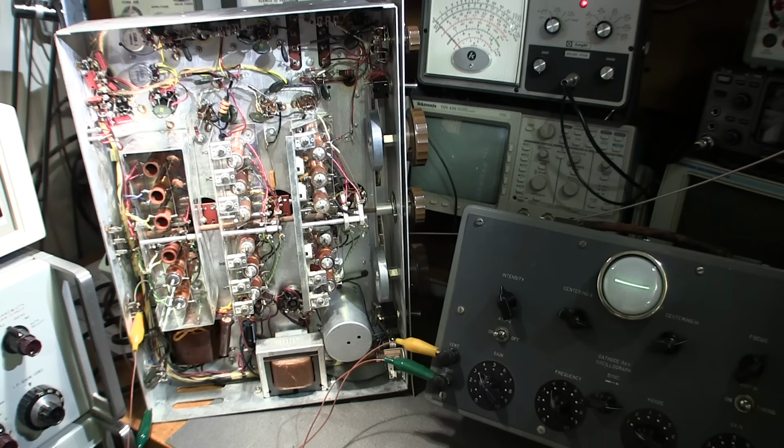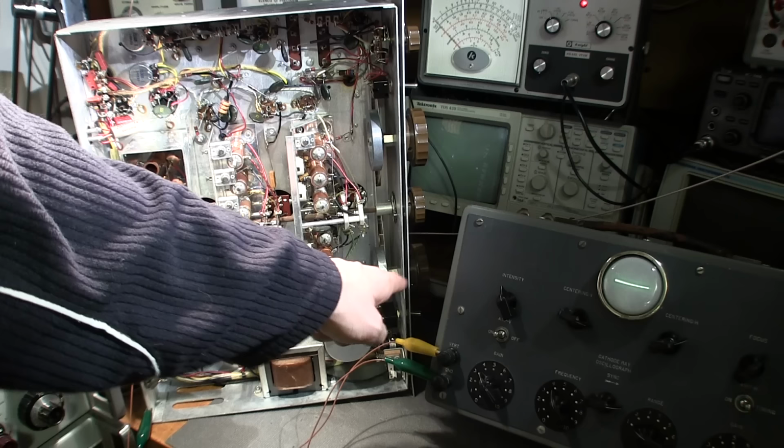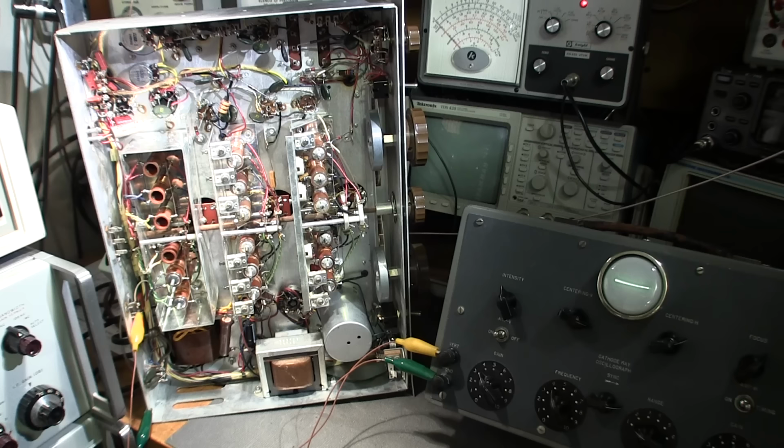So everything that's done on the bottom portion of the chassis here, that knob needs to be sitting at 100. It doesn't get touched at all throughout the entire alignment procedure. If it's off the 100 position, your entire alignment will be out. Very important. The standby receive switch is in receive. The sensitivity is pointing at 12 o'clock, and that is just picked with the signal generator output that I've got chosen right now. The manual AVC and BFO switch is in the manual position, and we're pretty much ready to go at that.